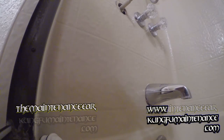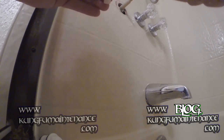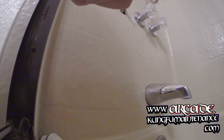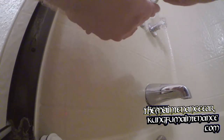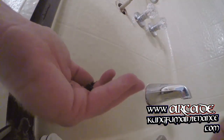Let's peek down in there and see if we have anything. Yeah, it sure seems like it. There's a little spring inside here in between these O-rings that presses out. There's the spring — and yeah, we definitely have a little rock in here. That was blocking it. There's the other O-ring, and there's the piece that was blocking — right here, a big ol' rock that just went right through and got caught in there.